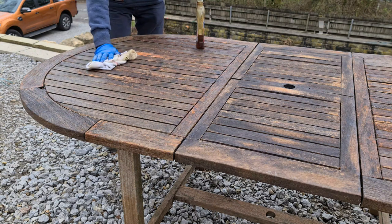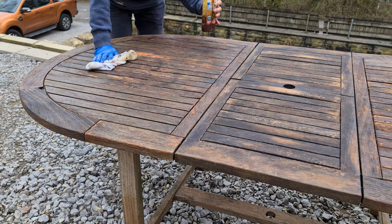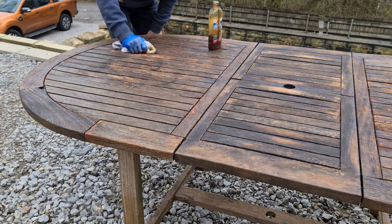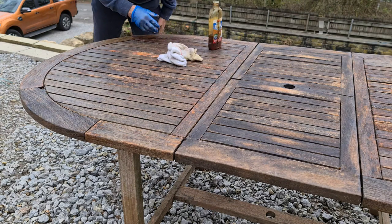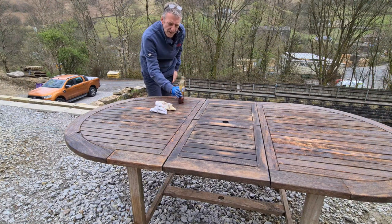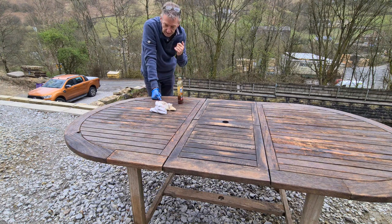That's it — leave that to soak in. It would have been nice if I'd had more, because I would have put it on with a brush and really allowed it to soak in and nourish the wood, but unfortunately that's not the case. That actually went further than I thought it would, so I probably will do the center as well. It's all matched up in color at the moment, so I'm going to leave it. The patina's back, it's clean, it's more than usable. For the sake of a pressure wash, I've brought this back to life — I'm really impressed.